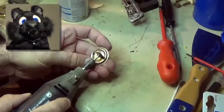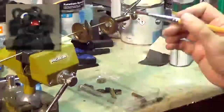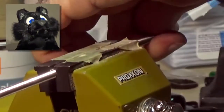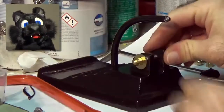The trimmings of the lamp were made of brass. I polished them up and gave them a clear coat to prevent oxidation. To connect the two pieces of the arm again, I decided to use a piece of threaded rod and some nice brass nuts, along with a bit of brass tubing to hide the rod in the center.